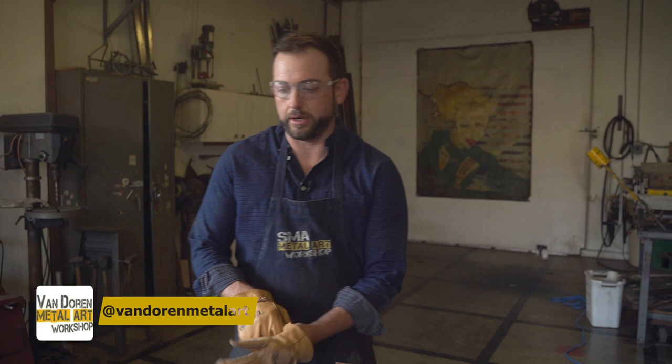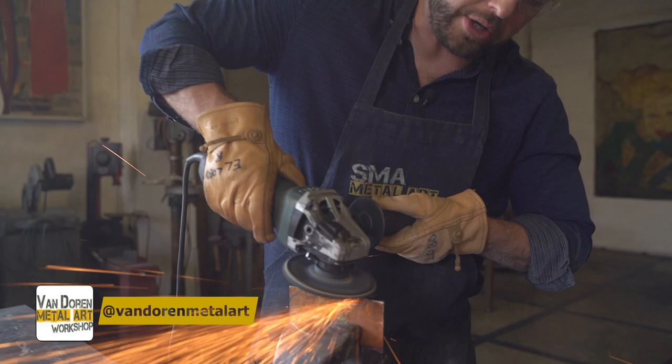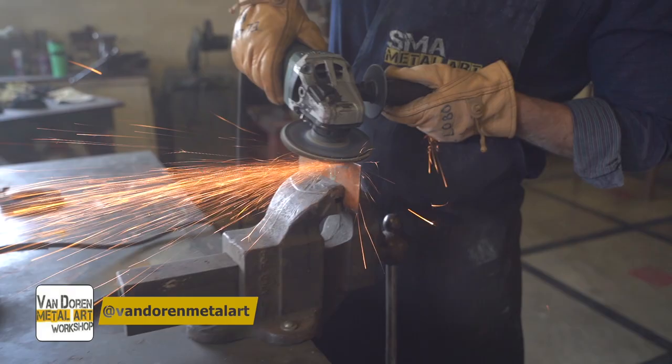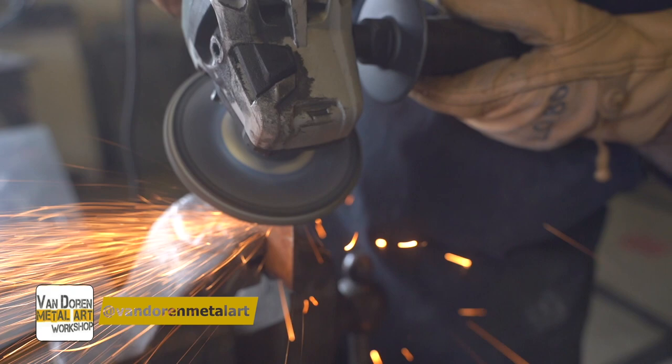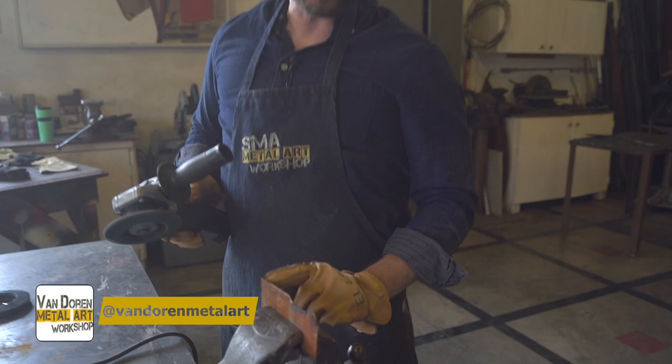Remember, up and in to start it. I'm going to put a pretty square piece of 16-gauge steel in here. It's all about pressure. If I put a little bit of pressure on, I'm just going to take a little bit of metal off. I put a lot of pressure on, I'm going to do a lot. Just a little bit of pressure — I'm going to make a slight dip in the metal. But watch what happens when I put a lot of pressure on — I make a huge dip in the metal. Now what if I want to roll an edge? In a flat motion, I kind of glide back and forth on it, and look at that — I turn the square edge into a round edge.